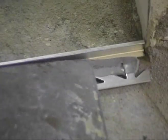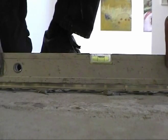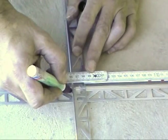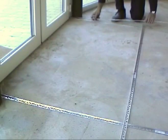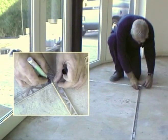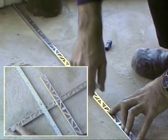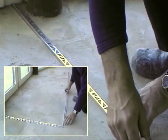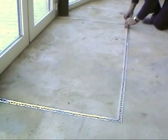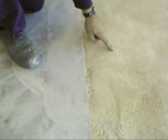Before installing our Sidec quartz carpet floor, it is important to ensure that the subfloor has a moisture content of no more than 5%, and that the minimum temperature is 10 degrees Celsius or 50 degrees Fahrenheit. The difference in temperature between the floor and the surrounding area must also be kept to a minimum in order to prevent condensation. It is therefore not advisable to heat cold rooms using gas burners, as this releases carbon dioxide and water vapor in the air.